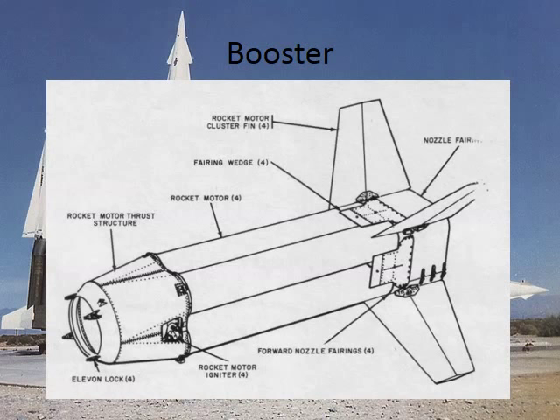This is a better view of the booster. Here in the top bottom left of the picture you can see the callout for the rocket motor igniter. These look like a paper bowl, but they were hard plastic — a pound and a half of plastic explosive with an igniter. We would screw those in, wire them up, and connect the cable to the control harness that would go down to the side of the launcher. These igniters were so sensitive that you had to ground your hand to the launcher, your body to the launcher, and the igniter to your hand, and the igniter to the launcher before you ever picked it up. Just brushing your hair out of your eyes would create enough static to fire one of those things. They were incredibly sensitive.